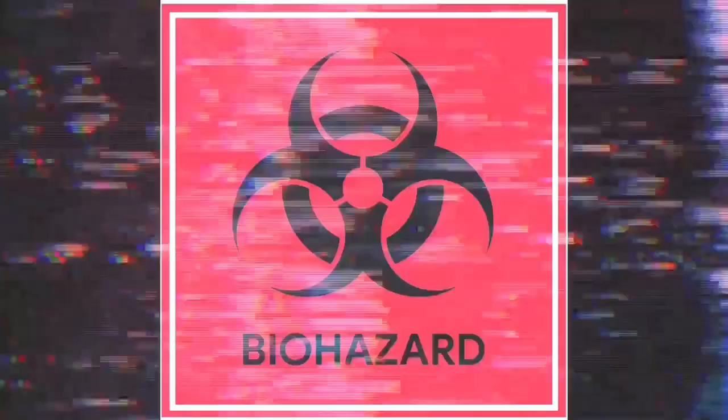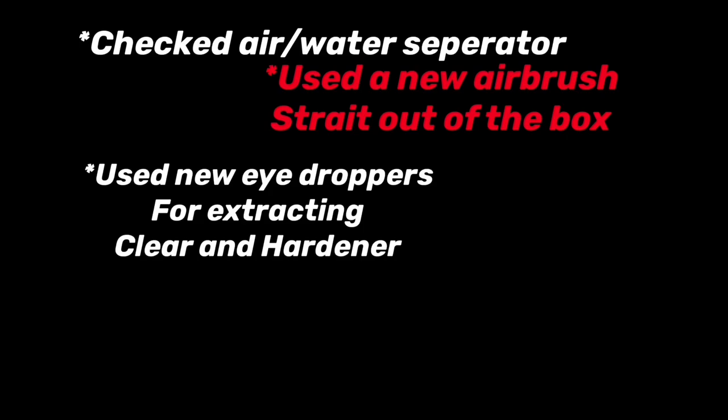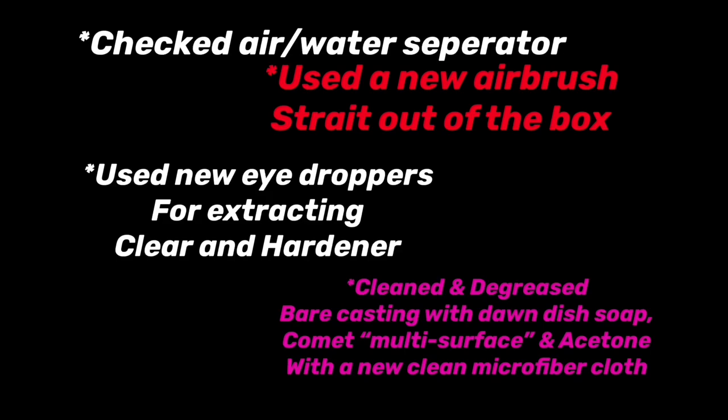All right, so this is what I did. I checked the air water separator. I used a new airbrush out of the box. I used new eyedroppers for extracting the clear and the hardener. Cleaned and degreased the bare casting with Dawn dish soap, Comet, and acetone with a new microfiber cloth. And then I did the magenta India ink with the 2K urethane clear. Son of a bitch, it worked. And it looks beautiful.